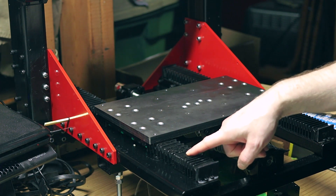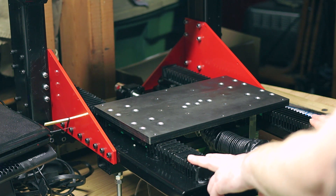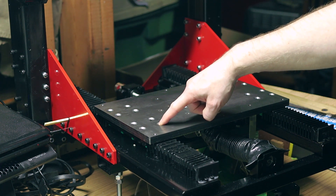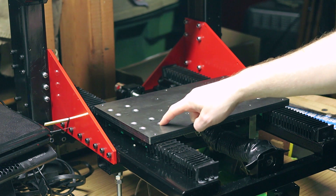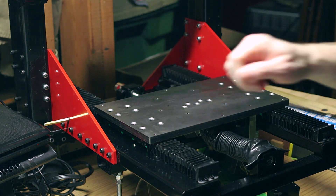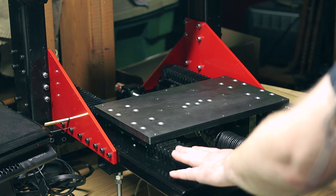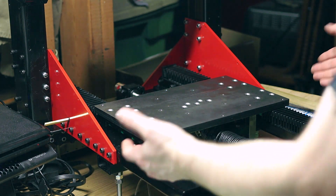To widen out holes in your rail you'd have to be very careful not to mess that up. The holes here are perfectly parallel — the spacing is just very slightly off. Because these holes are countersunk and the screws are tapered, the plate is going to self-align as you put them in. I went up one sixty-fourth from the original hole size, drilled them out, that wasn't quite enough, went up one more sixty-fourth, drilled again, de-burred them all, put it on, and was able to thread all of them in. Everything lined up absolutely perfectly — the two rails are completely parallel.